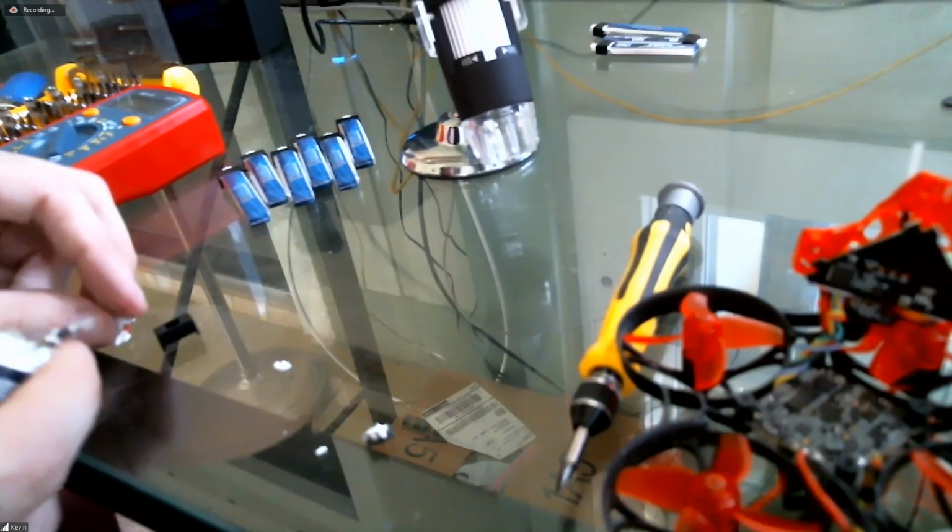So do we have any kind of short circuit here, like between these prongs? I guess we couldn't know for sure that you didn't do it when you took it and ripped it apart. Like, how could we get a short? So, hang on. This is a dead battery, and I'm just going to measure it and confirm it's at 0 volts. So this is a dead battery. Oh, it's at 4 volts. Well, that's not nothing.